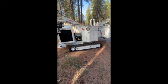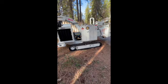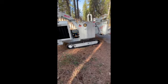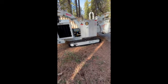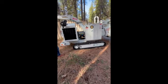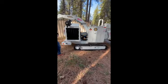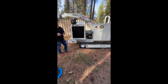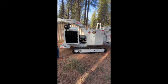Hunter? Yes, sir. I want to touch that. If you open up one of those jugs, you need to put all of it in, and if it doesn't take all of it, get rid of it. Don't store DEF once you open it. Never put a half-used DEF jug in that tank, ever, because it'll end up crystallizing and then go into the sensors, and it'll be a huge problem down at the Caterpillar dealer.